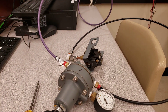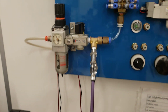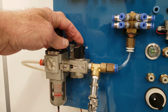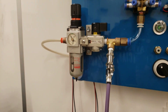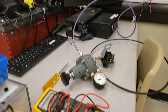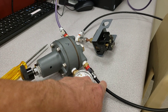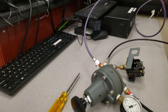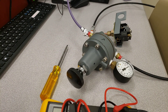Once you've got those connected, you can pressurize the system. Over here, I have to engage this ball valve all the way — if I go halfway, you're not going to hear yourself think; you have to go all the way. That pressurizes everything. So now we've got 50 psi in the purple tube going to the regulator, and from the regulator we're going to control 20 to 40 psi going to this switch.